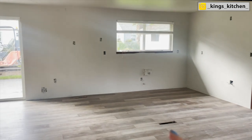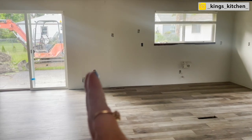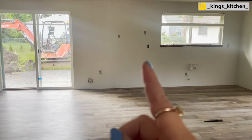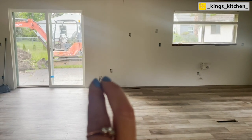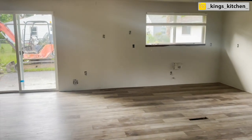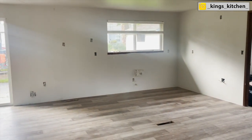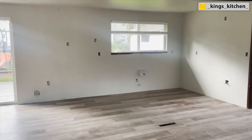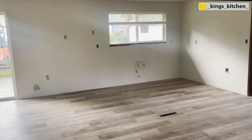I made a couple of changes in this section. The original kitchen probably stopped right here and it was a peninsula coming out. I took all of that away and I'm going to have some base cabinets here, a tall unit right here, and my refrigerator right here. There used to be an electrical outlet right here. When you're laying out your new cabinet drawing, you look at the space and ask: where is my electrical interfering, or where is my electrical or plumbing missing?